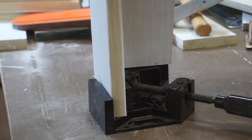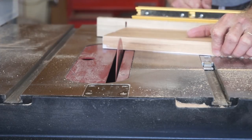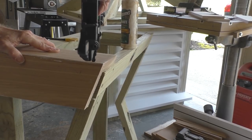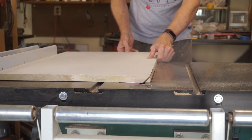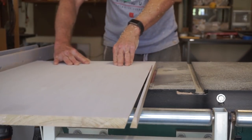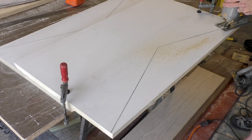I only have one of these right angle clamps but it's all I really need — it has a nice base to hold the wood vertically without tipping over. The trim that goes along the bottom is a little trickier. First I'm cutting a 19 degree bevel along the bottom, and then on the side piece I'm cutting a 19 degree miter. These bottom pieces are trickier because you have to make sure all of the angles are oriented properly. For the glue-up it's more difficult to clamp these so I'm using glue and a brad nailer. For the four side panels attached to the base, all pieces have a 45 degree bevel along the top edge, and two of the pieces have a 19 degree bevel along the bottom. I've marked the remaining two pieces so I can cut out a section with my jigsaw to make room for the peak of the roof.